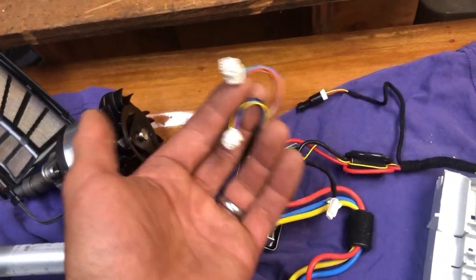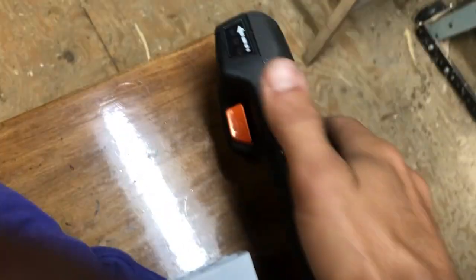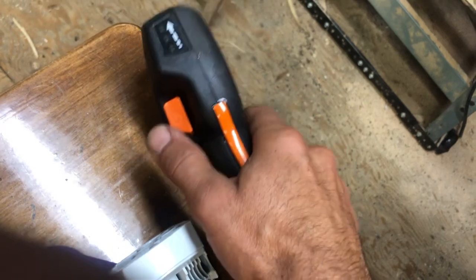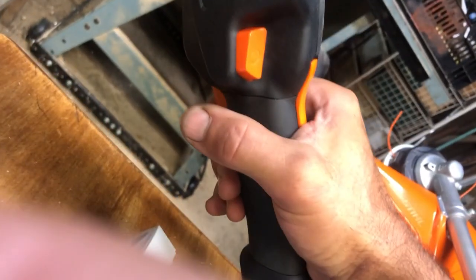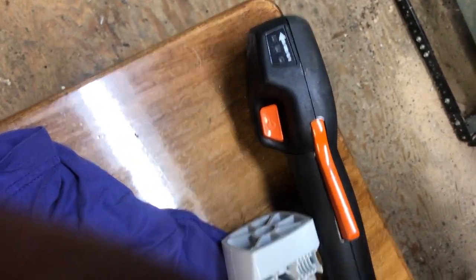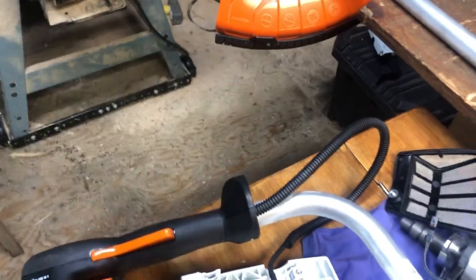Heading forward to the controls, there are just these two nice waterproof connectors. Once they're installed in the case they line up perfectly, and there's perfect strain relief, nice tidy cable routing, and it runs up to the hand grip. It's possible that even one of these moldings is the same as the gas saws. On the gas saw this would be your kill switch; there's obviously no battery LED. On the electric model you have power on, and then it'll show you battery state of charge, and then interlock and throttle. There must be a hall throttle in there for variable speed.